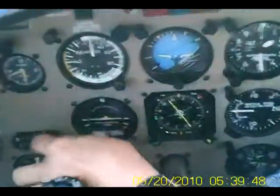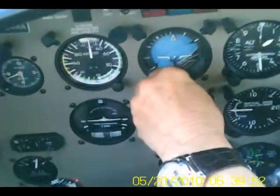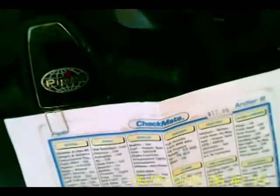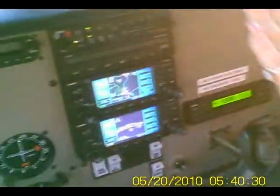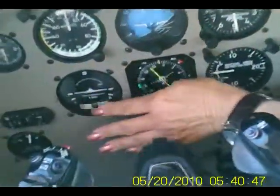We've got this gyro issue — it's 3 or 4 or 5 flights fine and then 1 or 2 flights it just starts up and rolls all over. It should level off. Altimeter's set. Radio test — radios are working. Taxi lights as required. Brake test — we check the brake, and we do another brake test when we start to go. Attitude indicator — now it's got an attitude. Turn coordinator — that's the ball in the center. That looks good.